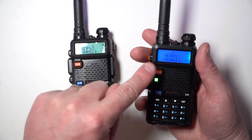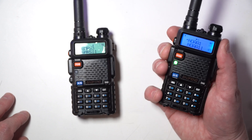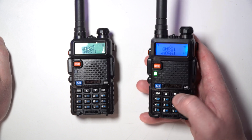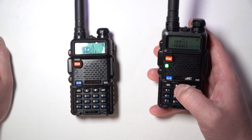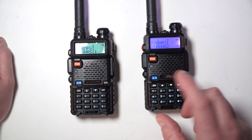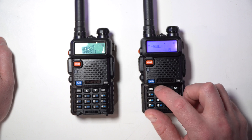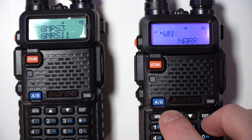The Baofeng, if left to its own devices, you should just be able to PTT if you don't program it not to. Trying right on the NOAA frequency — nope, not allowed. Well, that's good. This does have dual watch capability. You can go to the B channel and listen to a lower frequency. The menu system has starting at 0 and going to 40 — this looks like the menu system for just about any Baofeng you would expect to see out in the wild.